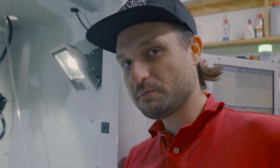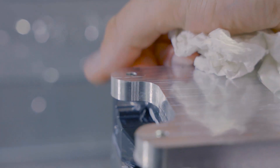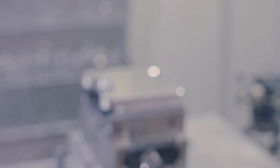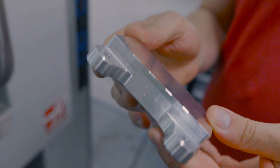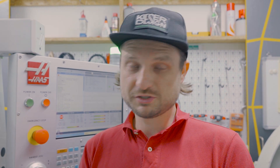What we're going to do now is dial in the part once more, now that we have the precise edges. Then we put a chamfer on the outside edge so that whoever uses the jig won't cut themselves, and then the part is done. I need to mark the angle now, but machining the sloped surfaces where the indexes will sit is going to be quite a challenge — something for another day.